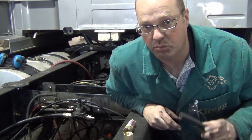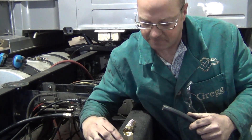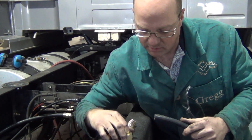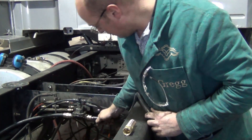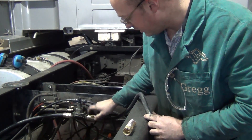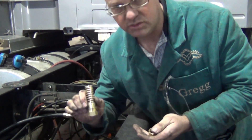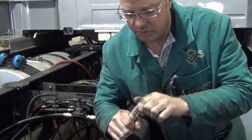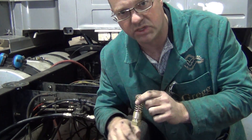We're making up the airlines to the brake pots now. I thought I would show you how we're able to make them here in our own shop. We've got these compression type fittings - it's got a little ferrule that when we slide this over the line and tighten it down, the ferrule squeezes down on the hose and makes an airtight seal. I want to point out that the lines that go down to the brake pots should always have these springs on them. Because the axle is moving up and down, we want to make sure this gives it a little more support so we don't wear through those airlines too quickly.